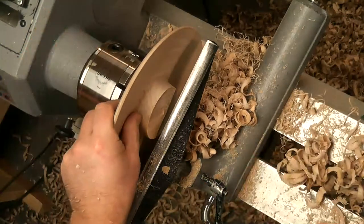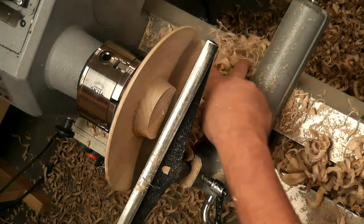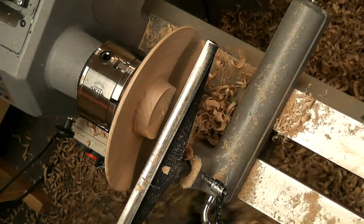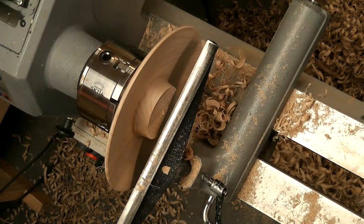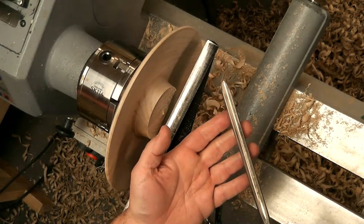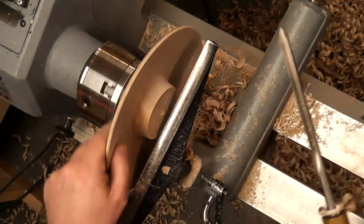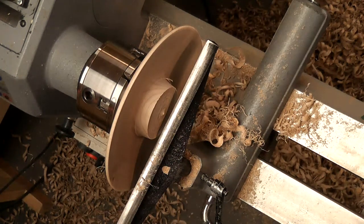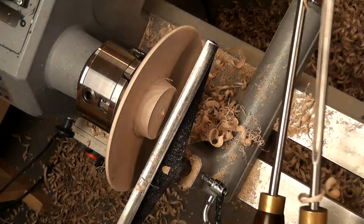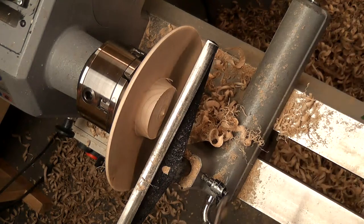Yes, Ben. So we've got a few questions about the amount of material that came off then. First one's from Bill. He's asking, what size bowl gouge are you using to remove so much material? This is a 3/8, so a 9mm bowl gouge. And that was the one that you were taking those stepped cuts with? Yes. I pre-prepped two gouges, both nice and sharp before starting, both the same size, just so it saved me going away and sharpening one to continue.